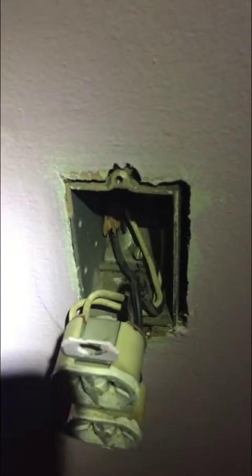In these old outlets it doesn't really matter — you just have to match hot to the hot side and cold to the cold side. The black wires are your hot wires, the white wires are your neutral wires. But in the GFCI outlets we're gonna replace this one with, which have certain safety advantages — especially since I have a kiddo — we have to figure out the line and load side. Because if you don't put the wires in the right places, the outlet will not work and you're just asking for headaches.